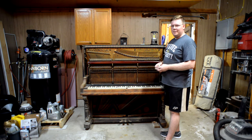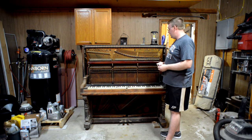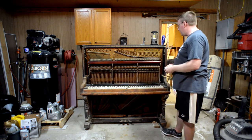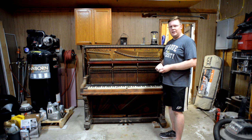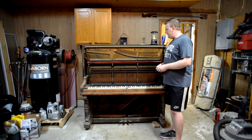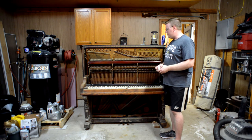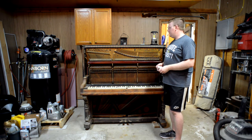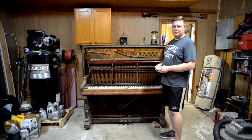I think it would just do a lot better for the piano itself to replace them with new hammers. A lot of these action parts, I'll go through and check, but my plan there is to do really all the repinning and replacing all the felts and bushings most likely, with their age, going through all the bridle straps, leathers, everything. But I'll probably keep as much of the original wood components as I can. So that's really going through every little bit, piece by piece, and bringing it back up to modern working condition is my goal.